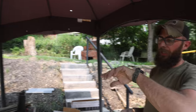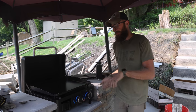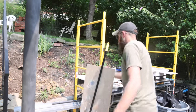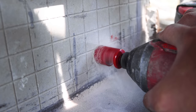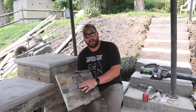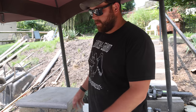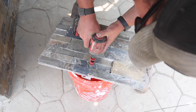This is looking fantastic. It's now Monday. The last little bit that needs to be done is over here on the side of the griddle — the gas line needs to go through it. We ended up having to order a longer gas line because of the way we designed this; we don't want to drill through the countertop. If it goes under the little overhang, it'll work out better. We got a diamond cutting hole saw to punch a little hole through the side. Sam and Jordan just dominated finishing up the stonework. Now we've got to get this thing cleaned up, but first we want to create a better opening for the hidden door — which I honestly did not think was going to work, and somehow it is. We also need ventilation for the propane storage area, so we're putting a couple of holes in the door to allow for plenty of airflow, plus a little hidden vent in the corner.